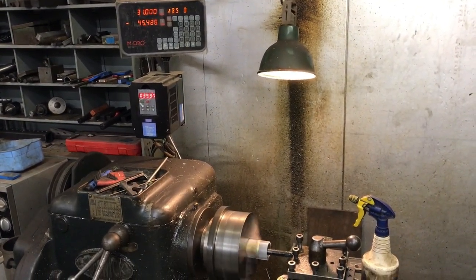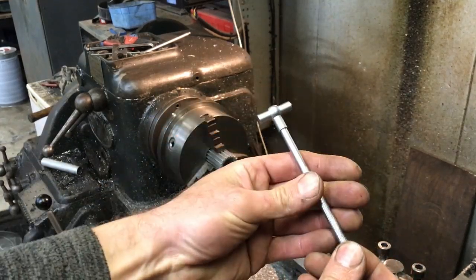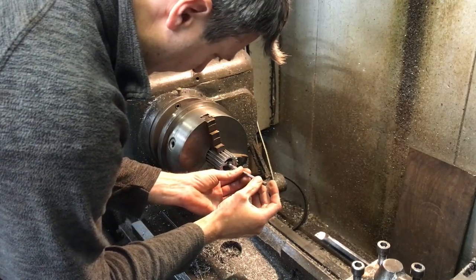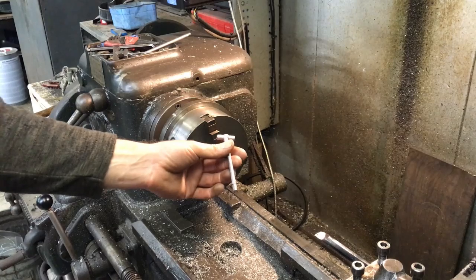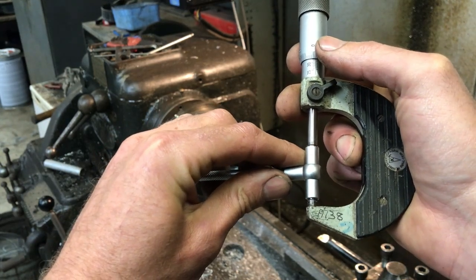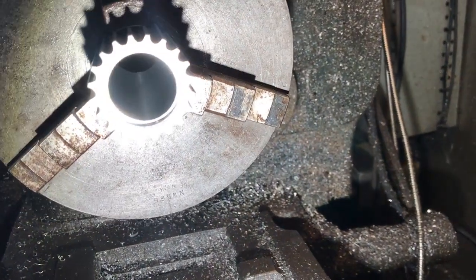Boring this pulley is going to be difficult. I want a parallel bore within 0.02mm and I want the size within the same tolerance. The bore bar is sticking out over six times the diameter of the bore bar — normally you wouldn't exceed three times the bar diameter, but I've got no choice here. This means the bar will spring a lot and plenty of spring cuts will be needed. The spindle speed will also have to be kept low as it will chatter otherwise. To make sure the bore is parallel within tolerance, I'm moving the cutting tool in diameter as it's cutting. The lathe will bore parallel within 0.1mm over this length, but that isn't accurate enough. To measure the bore diameter, these bore gauges are quite good. That's come out really well and I can press in the one-way bearings.